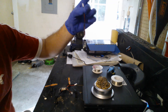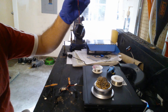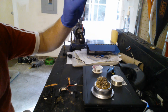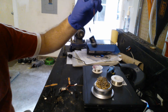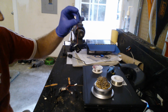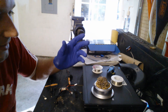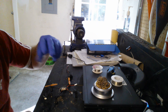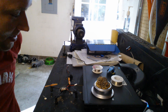All it needs is a one-cell battery. You can use a two-cell as well — it won't damage this. A one or two cell is fine for this video camera and transmitter. I've already verified it works with the Fat Shark Goggles V2. Channel 8 — set it up on channel 8. You might have to change through your channels on your goggles to find out which one works, but you'll find it right away. It comes in the instructions — you'll figure out channel 8. Thanks for watching guys, and next thing you'll be seeing is this thing flying FPV when I record it through the converter that comes out of my goggles and goes into my computer. This video is going to be awesome, I'm telling you.